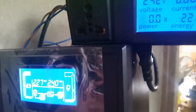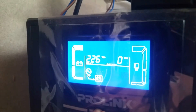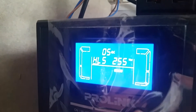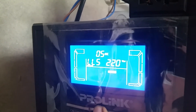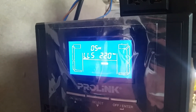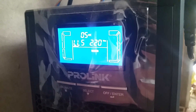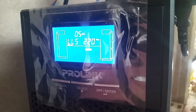But when the voltage sensor is incorrectly calibrated, this is an issue. Inside the settings of this UPS there are options that configure high and low voltage thresholds at very fine resolution. Why have these settings at such small resolution if you can't get the voltage sensor right? When I connect this UPS to a computer, it reports values like 230.1 or 230.2 — it's supposed to be very accurate — and yet here we have an incorrectly calibrated sensor.